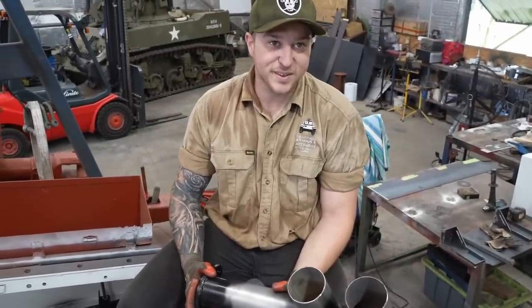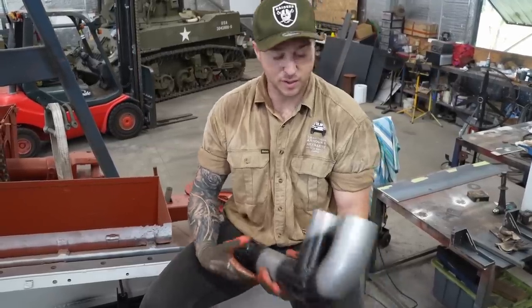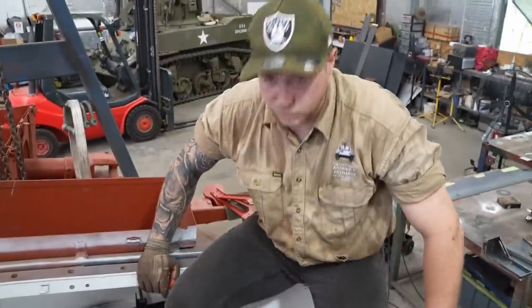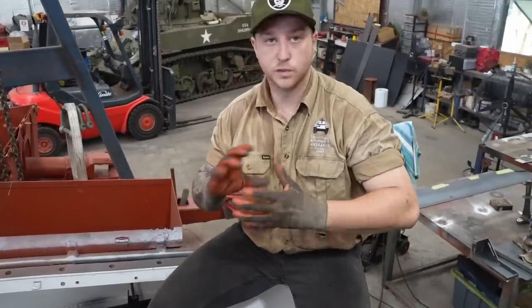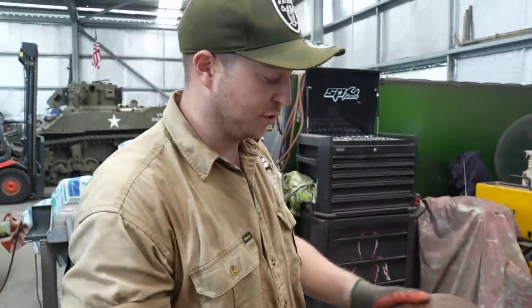That's a good attention to detail. I don't really make them ready-made, so I've had to modify and make my own. Because this is fixed on and solid, there's going to be no flexibility, so you'll find the closest weak point and crack one of the welds — we don't want that happening. That's why I want to put a flexible exhaust fitting.